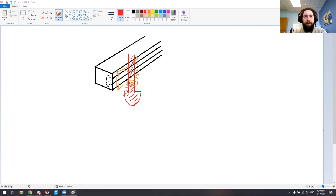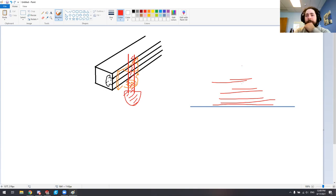Before jumping into SOLIDWORKS, we need to think about what approach we want to use. One of the first important things is that as we print parts, they're laid down in layers on the build plate. Strength within the plane is better because you're extruding continuous lengths of plastic, versus out-of-plane where you're relying on a bond between a cooled layer and a new hot layer being laid on top — and that bond tends to be weaker.